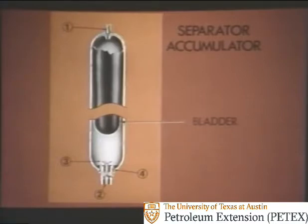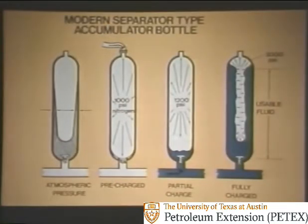Let's take a closer look at bottle-shaped accumulators with bladders. The bladder is shaped like a tapered cigar when there's no pressure on it. This tapered shape gives a pushing or squeeze action when fluid is discharging. Then, 1,000 pounds of nitrogen pre-charge pushes the elastic bladder to the bottom and closes the poppet valve to prevent the bladder from being pushed into the port opening. Hydraulic fluid is pumped in and the 1,200 PSI minimum pressure is reached quickly. The bottle is fully charged with fluid to 3,000 PSI working pressure.